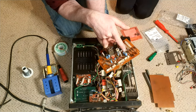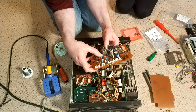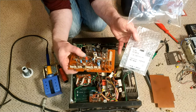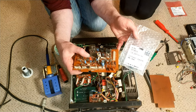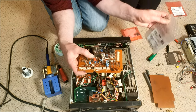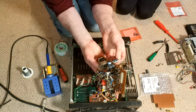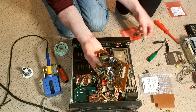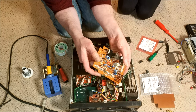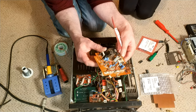100 microfarad at either 16 volts or 35 volts. So we're just going to put, is it 35 or 25? 35 volts. So we've got 100 at, what's that? That's not the right one. So we've got the 100 microfarad, 35 volts, got a load of those. So we'll just change them all with that. We've got this one, which is 1000 microfarad, 35 volts. See, that's considerably smaller, as these things tend to be these days. Got 10 microfarad at 50 volts, that was that one. Yeah, and 22 microfarad, which is that one.